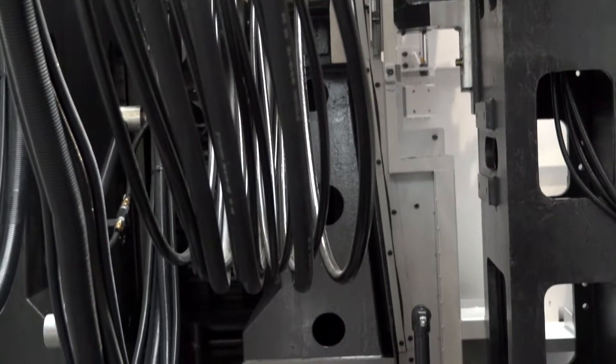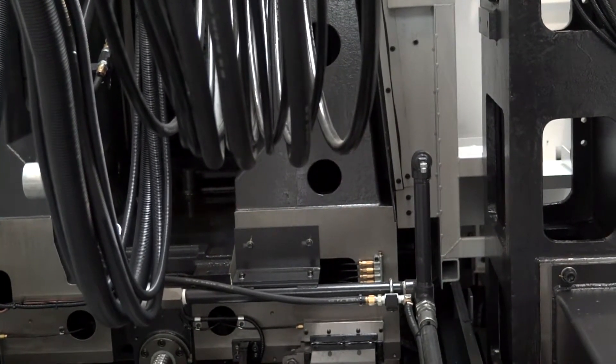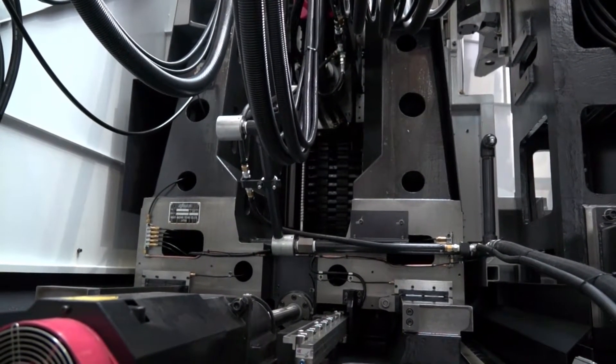So it's like a Y-shaped column, yeah? Effectively yes. And then I suppose you're spreading the load across a bigger area? Yeah, you spread the load over a wider pitch, and not only do you do that on the column and the Z-axis, you also do it on the X-axis as well, and you go a wider pitch to give it a more rigid, wider stance.